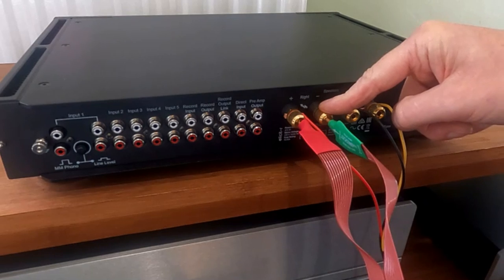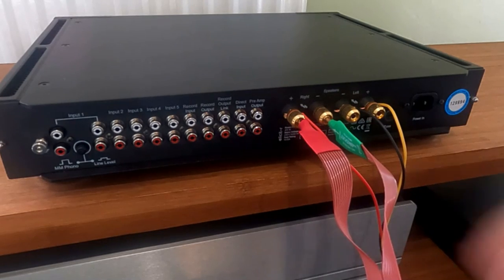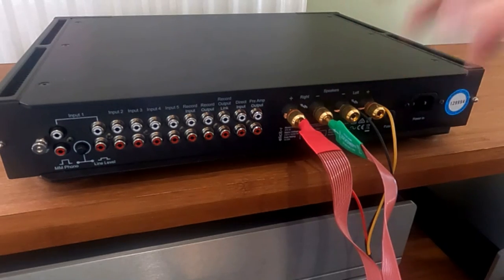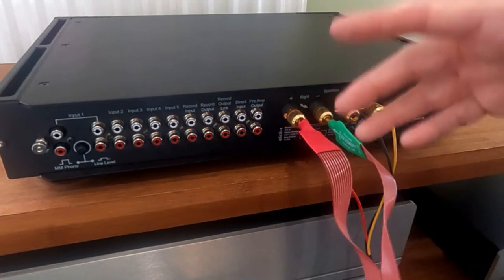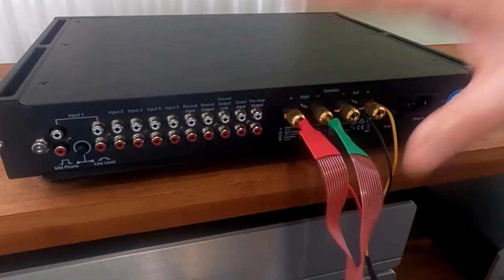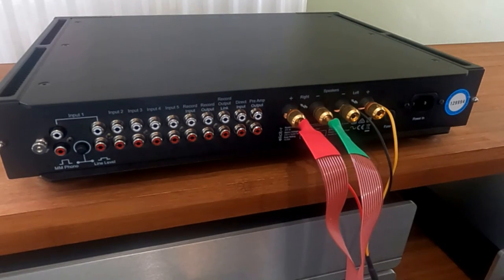What the high level does is it takes a very high impedance signal — it sort of sneaks a bit of signal off the amplifier. It's not as though you're connecting up another speaker. The amplifier isn't driving the drive units as such. It's just sending a high level signal to the preamplifier internally, which then sends the signal to a power amp. So the amplifier doesn't really know it's there. It's quite a clever way of doing it.